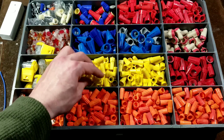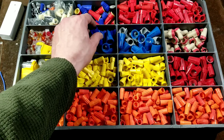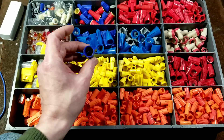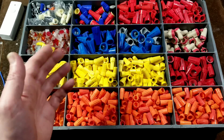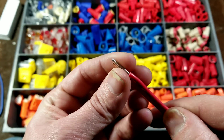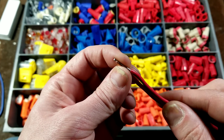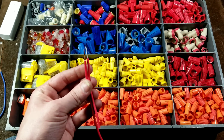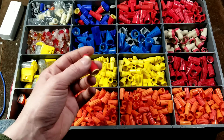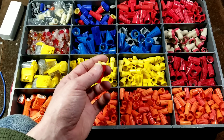Smaller high-quality ones also include wings. They also have metal inserts — a square type of wire coil — which is the actual metal part that binds into the wire. Not only are the two pieces of wire crunched together by the nut, but the metal coil itself also adds conductivity, which is why they can be reliable. You can also use wire nuts in damp locations, outdoor locations, or even for an emergency repair on a boat trailer.